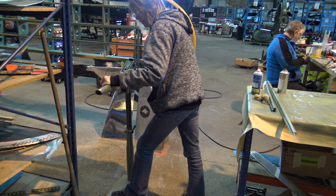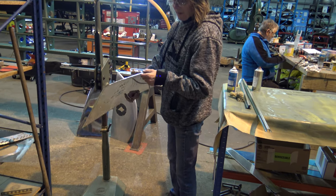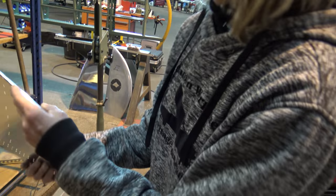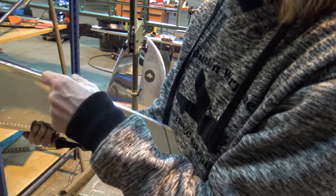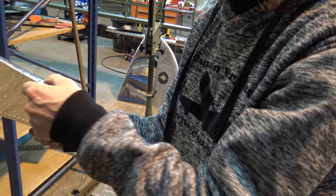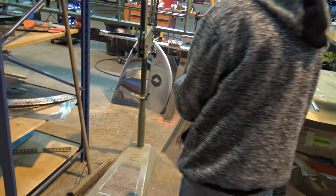Do you try to avoid where you've already crimped? Yeah, just nice and even. Because that must go hard as you work it. Yeah. But when it's finally done and it fits, I'll over shrink it a touch more and then go through the wheel so it'll blend all these little nodules. Oh, good.